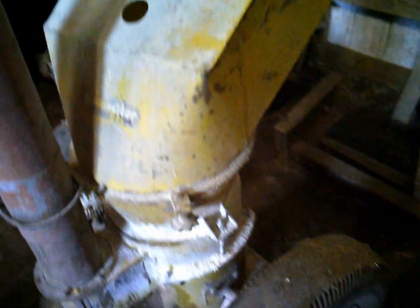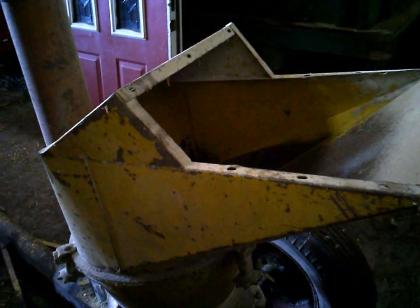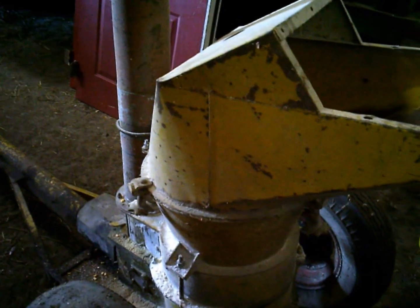Grandpa bought this thing back in the early 60s, brand new. This is about the only model I've ever seen of these. They had a couple options — some of the earlier ones had little short tires, and at some point they changed to these taller ones. It's a 540 PTO shaft. You just dump the corn in here and it grinds it and augers up and goes out the end. Some of them had a self-loading option — just a little auger that went down and you pulled it up next to a gravity wagon. Grandpa never ordered that option because they always loaded out of the back of the grain truck. Now I use a gravity wagon so I'd kind of like to have it, and this summer I might try to rig up a hydraulic motor and a little self-loading auger, since I'm grinding more and more corn.